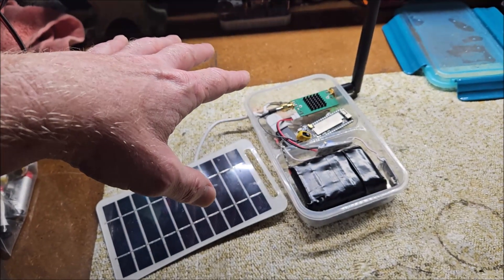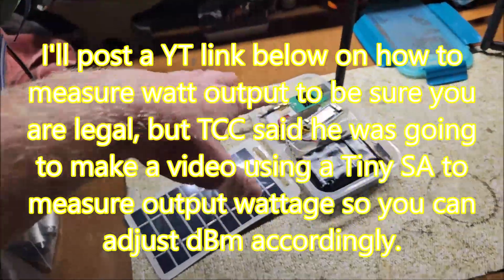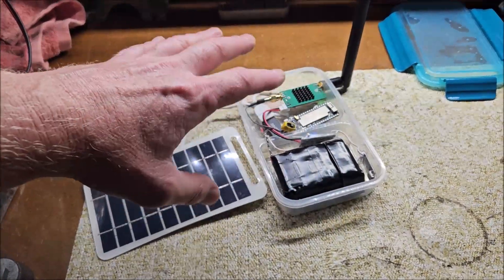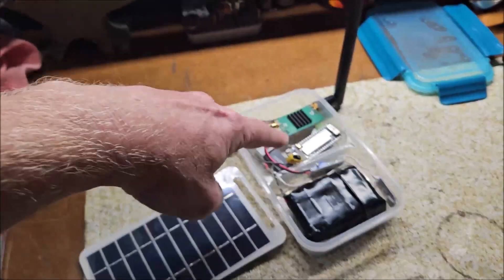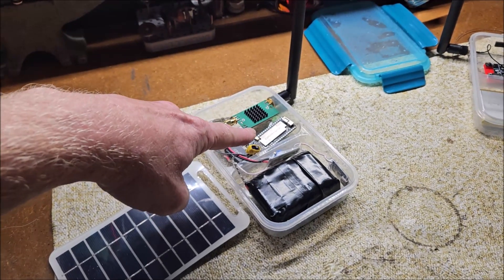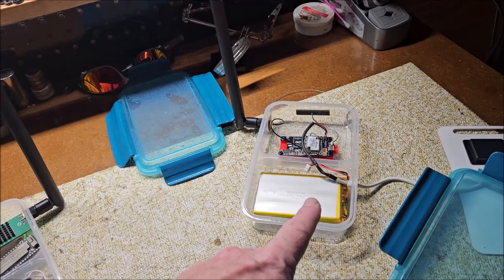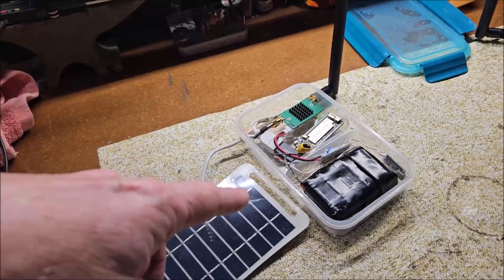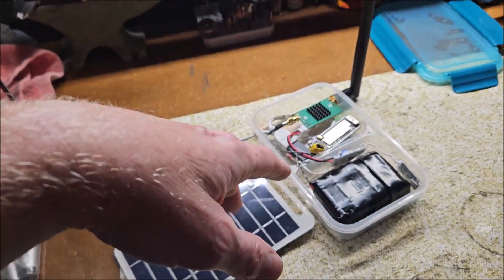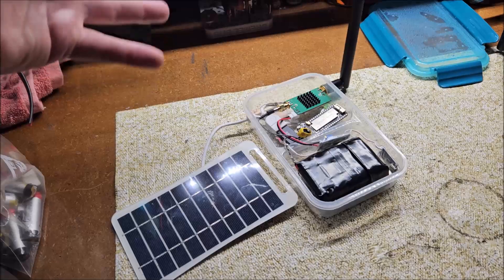All the fine-tuning is beyond the scope of this video, but you can legally only run one watt with this LoRa stuff. I discovered that running this in router mode is about the same energy consumption as running it in client mode. I also discovered that router mode really does work, and that has enabled me to run this node solar powered for six or eight weeks outside.